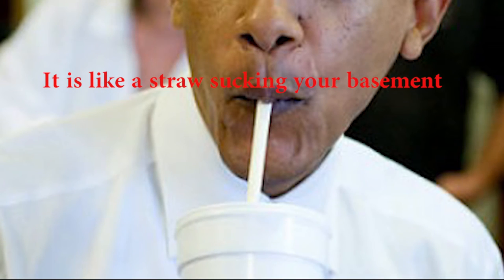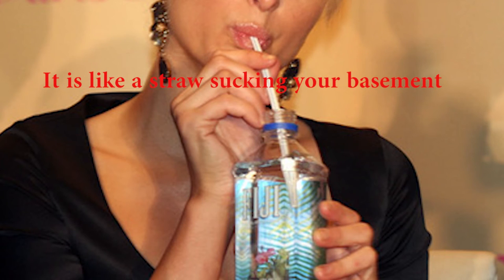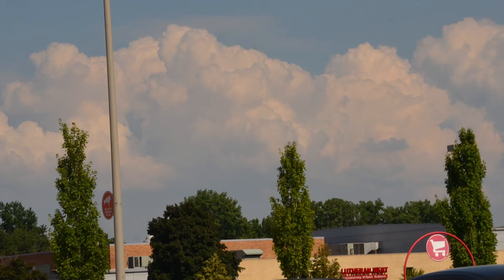The non-condensing dehumidifier salesman will tell you that moisture becomes heavier as it cools and settles to the lowest point in the home, and that his contraption will pull the moist musty air right out of the basement or crawl space. This is simply wrong. Moist air rises and forms clouds in the sky — just go ask your weatherman. Moist air is not heavier and does not drop to the basement like the salesman states.